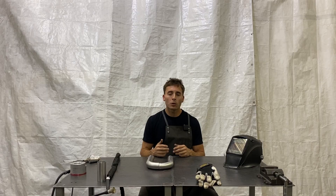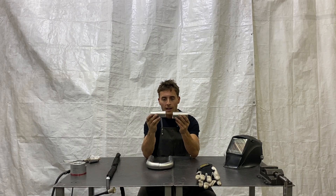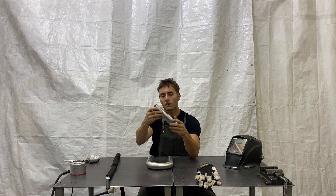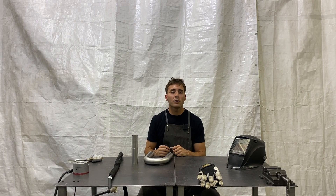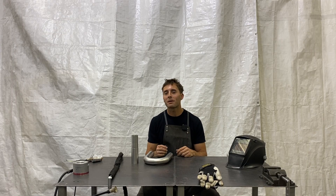I've had several requests to do a video on welding lap joints specifically. If you're new to the exhaust building world, I just want to spell this out briefly — where the smaller tube actually slides into the larger tube, and the larger tube overlaps a little bit, and you come in and weld that step. For this tutorial, we're going to be using 18 gauge 304 stainless steel exhaust tubing, which is pretty thin, so this will be good practice.